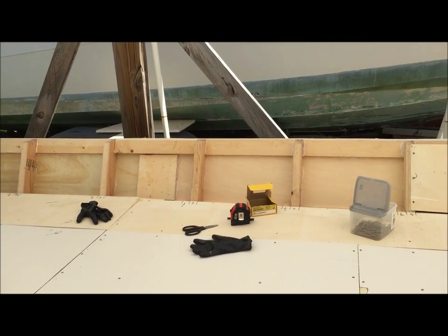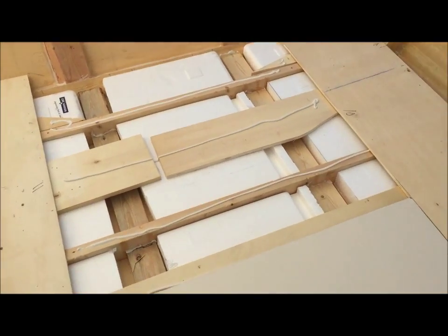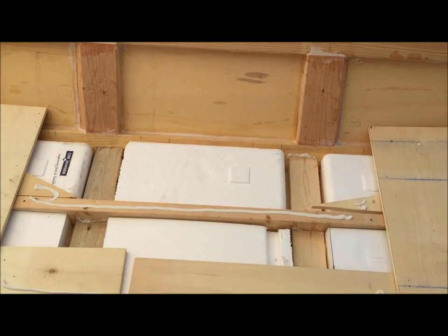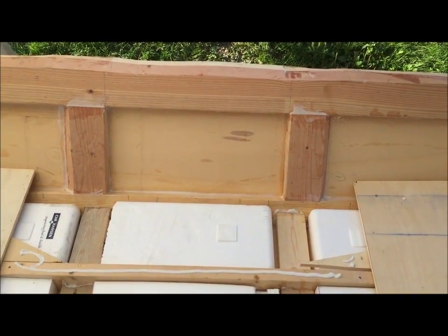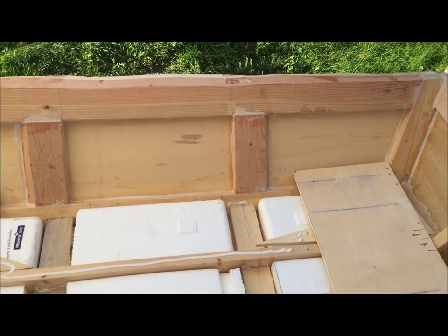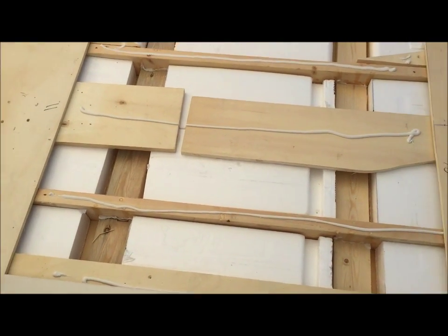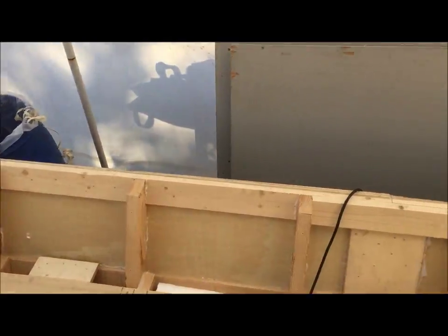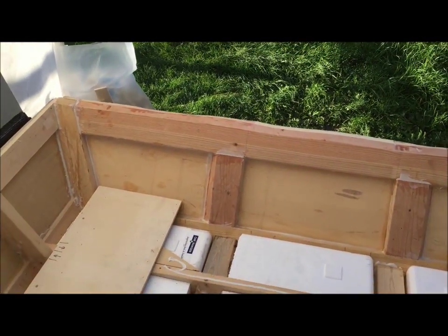We are laying down the last of the flooring right now. I just have a few cords underneath there to shim everything up. I left that one section empty because I might end up cutting that board back out around the edge of the foam, picking the foam out, and making that more of a sump for drainage — but I'll have to see, because I don't know if I want to drill through the bottom board for drainage. That can always be modified later. We got the lines of the subfloor caulking down, and we're putting them down, running screws in, then doing the same along the sides.